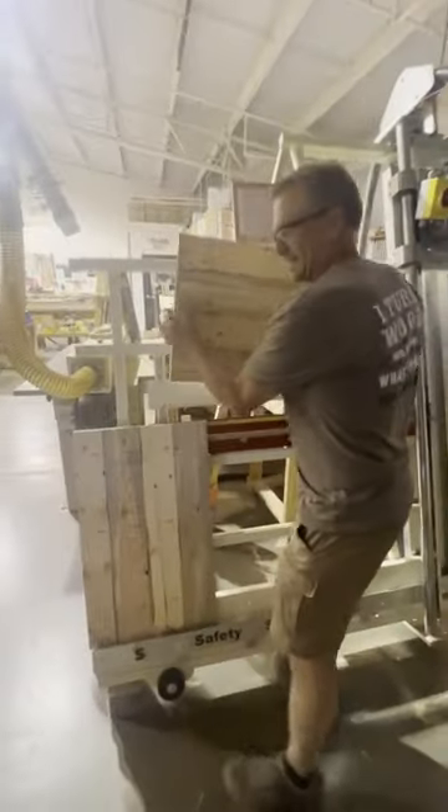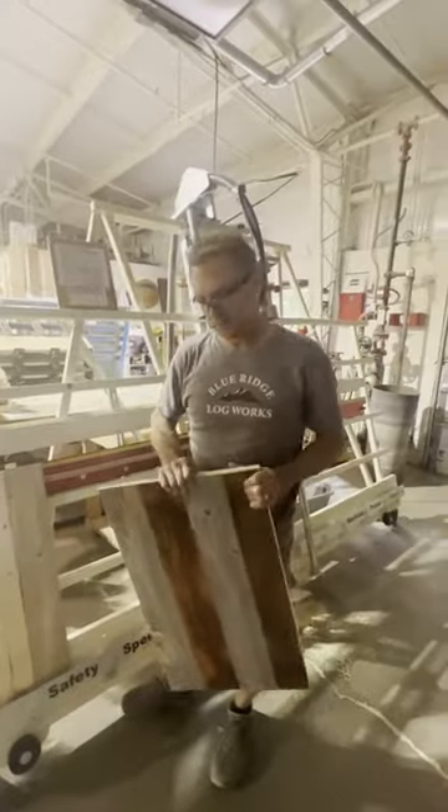You may have noticed I struggled to make that cut — it was because the guard for the saw blade hit the very end of the board. If you're in a certain place it can get stuck, so you need to cut a little more out to get that to work. Now we're back to the table saw to cut these two to 29 inches tall.